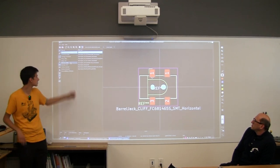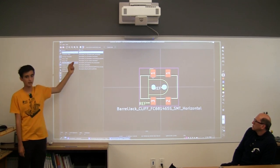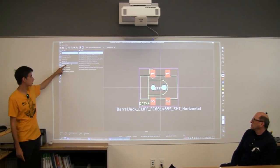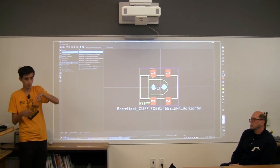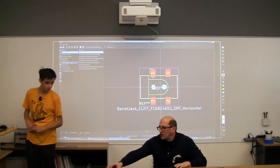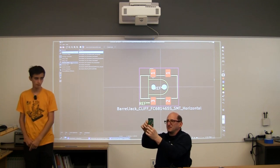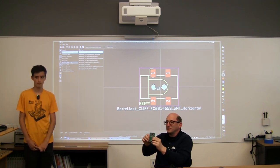Okay, there's two types of resistors, called SMD and THT. SMD is surface mount. You can solder it to the surface, and that's where it lies. THT is through-hole component. So it's one that goes through the board, and you can actually physically get it through the board. Kind of like on this board here, the connector is a through-hole connector with pins on the back side of it that get soldered. So the pins went through the board and then were soldered on the back side, so that's through-hole.